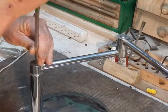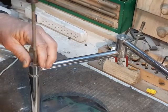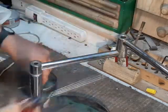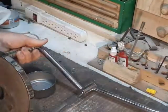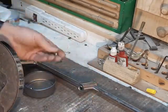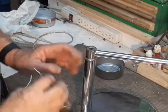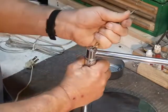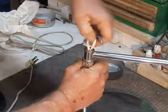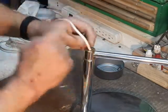Each of the joints has a screw plug here at the top, which are fairly easy to get out. And the swivel here has one on the bottom as well. One sign that this lamp has never been worked on before — all of these are still here. The unusual thing about wiring this kind of lamp: it's a job that you actually start in the middle. This little trick here of pulling it up and outside, that's the way we're going to go through the whole lamp.